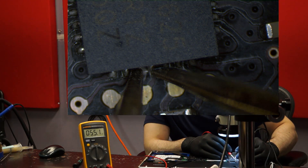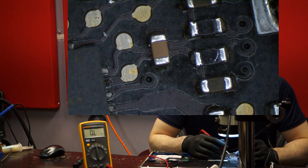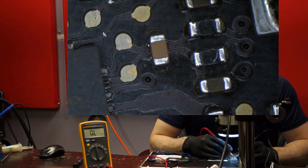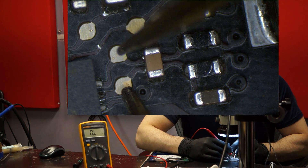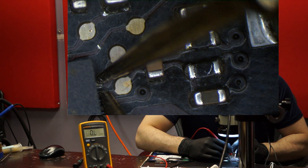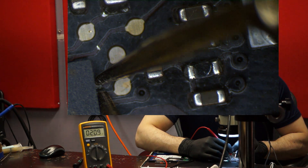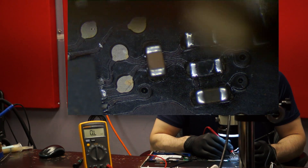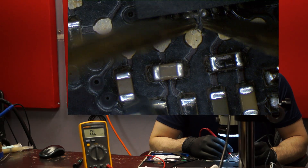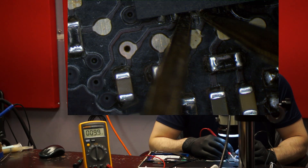We measure from here and here. What is it? 56 kilohms, 55 kilohms, whatever it is — it's way more than the 2.3 ohms I was expecting. Now let's measure the charging current sensing circuit. We measure the resistance between here and here. That's 20.03, 20.09 — same thing for the most part, which is negligible and fine. But here's where the real problem lies — the battery current sensing circuit. Now I have to figure out which part of it is blown.